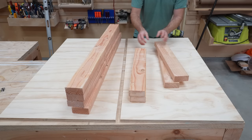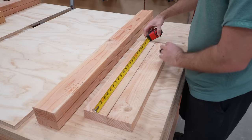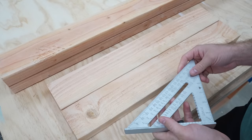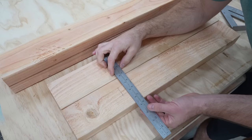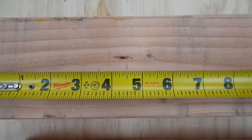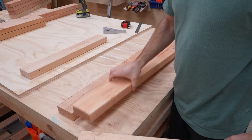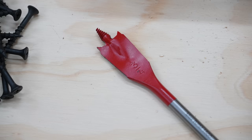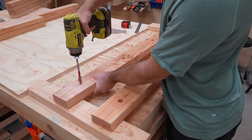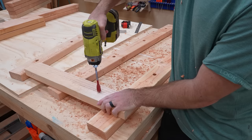This is a really important step. I'm going to drill 12 holes in these four boards in specific spots. The 24-inch boards get holes at 6 inches and 18 inches, marked in the center of the board. You could use a speed square and mark the center at 1 and three-quarter inches, but since these boards were a little swollen, I used a ruler instead. The 45-inch boards get holes at 4 and a half, 16 and a half, 28 and a half, and 40 and a half inches. Once all those spots were marked with a plus sign showing the centers, I used a three-quarter-inch spade bit to punch all the holes. I'm using half-inch bolts, so having a slightly larger hole gives some wiggle room for inconsistency and unlevel floors.